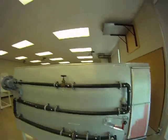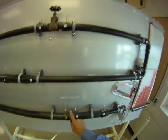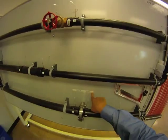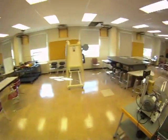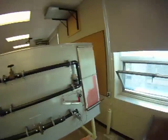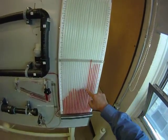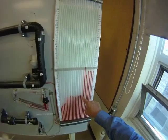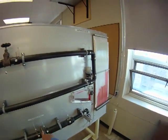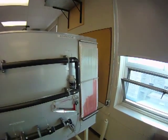The orifice plate is a measurement device, and it produces the single biggest pressure difference you see on the manometer — between tap 14 and tap 15 on either side of the orifice. On apparatus number two we have a one-inch diameter orifice; on apparatus number three we have a 1.054-inch diameter orifice. That twentieth-of-an-inch difference doesn't seem like very much, but it will make a difference in the pressure drop for a particular flow rate, or in the flow rate you calculate for a particular pressure drop. So if you were trying to get a particular flow rate, you would be aiming for a particular pressure difference between those two locations, and you'll do that calculation in the tutorial today.